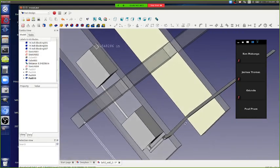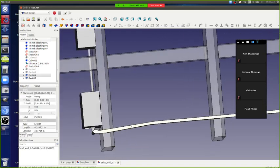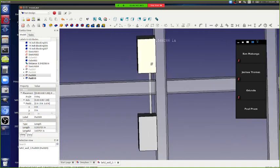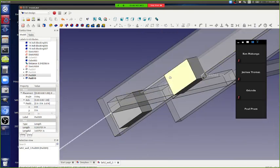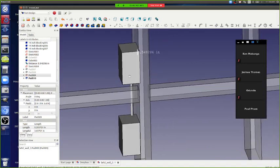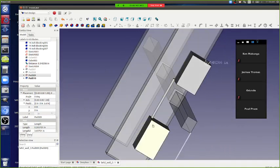But in the finished module, it will not have this wire that we can hide, but it will have the connection between this one and the actual junction box. So we cut a stub of wire that goes into here, with enough length so we can actually wire up the outlet. Now the outlet, when do we want to do that? Since rough wiring means just wire sticking out of boxes, that's the way we leave it for the inspection phase. So connect this wire.